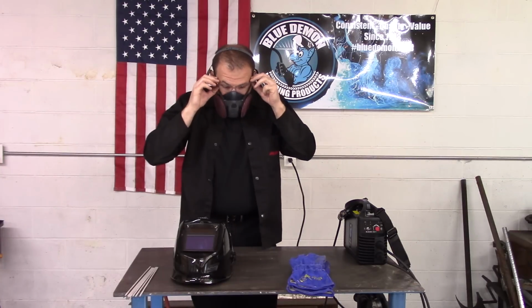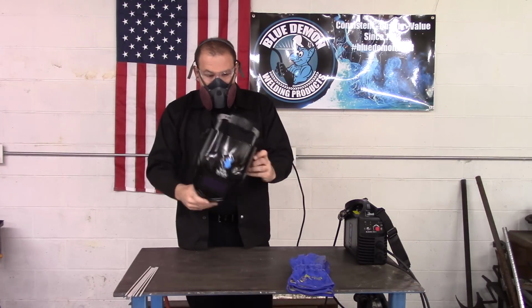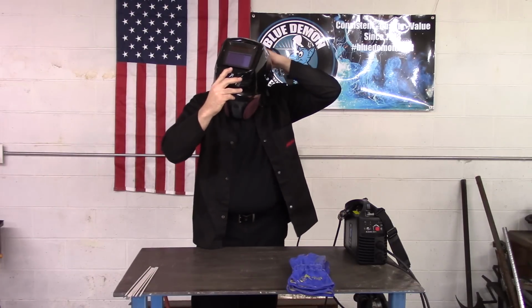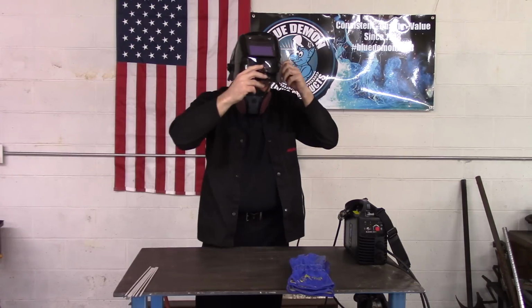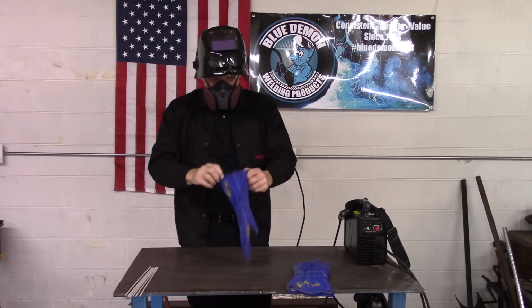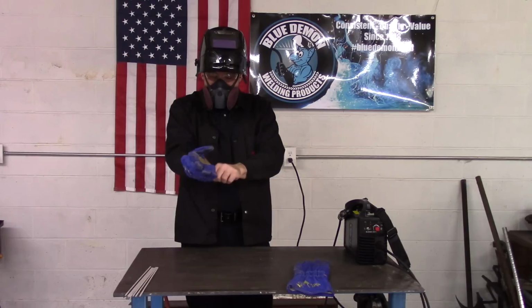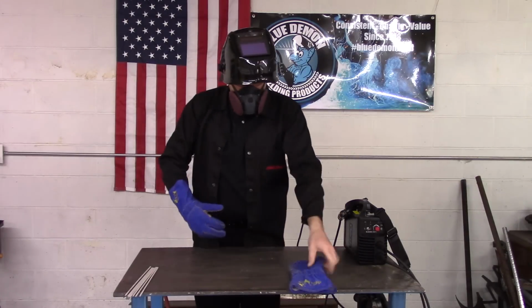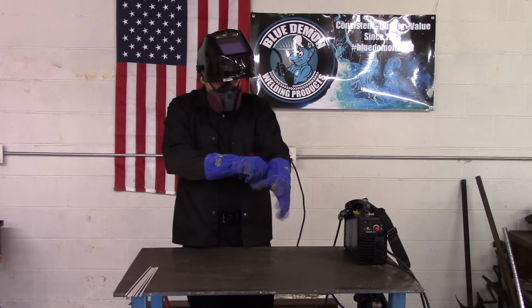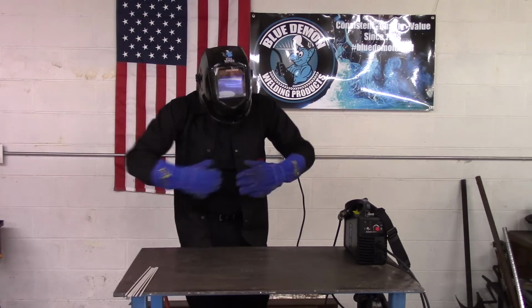Here's a tip. Many welders will wear a small respirator, like the one seen here. It filters out some of the harmful things floating in the air. The other thing it does is direct the hot air you breathe down and out of the hood. If you've ever welded before, you know the lens can become so fogged you can't see anything.